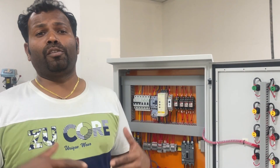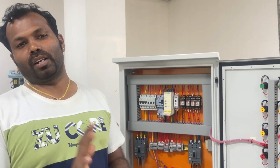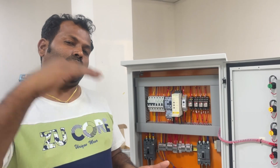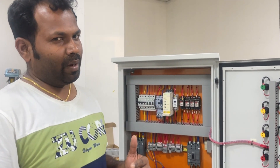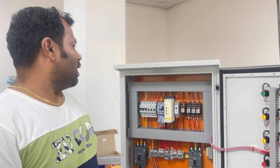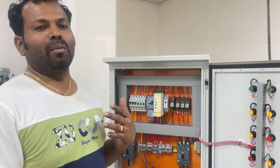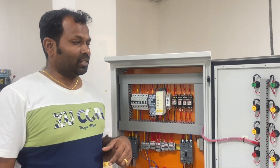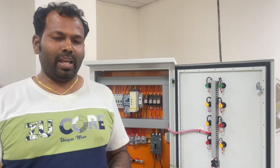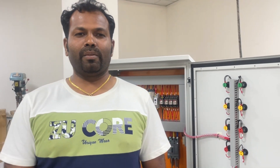From which rating can you go with a soft starter? If the motor is important to you, consider a soft starter. My recommendation is to go with soft starters from 4 kilowatts and above when you are not controlling the speed. With a soft starter, you can save power, protect your motor, and reduce maintenance. Next time when you are designing panels or machines, make sure to choose your starters according to the motor kilowatt rating. Thanks for watching — if you have any doubts, write in the comments and I will reply. See you in the next video, bye from Sanapa.